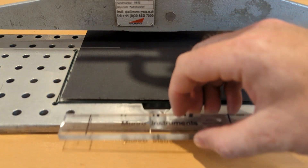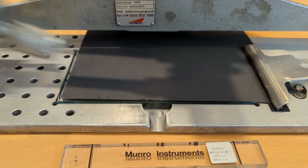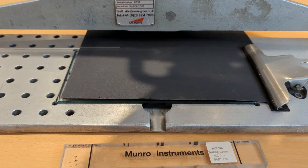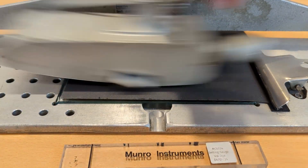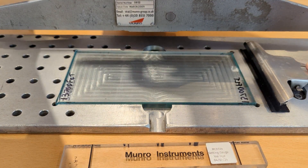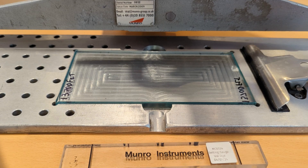With the contact patch set you're then ready to start swinging the pendulum, which will abrade the edge of the rubber slider. Because I'm refacing the slider I'm only going to do three swings, but if this was a new slider you would need to do ten swings, then reset the footprint, then do ten more swings just to put the bevel on the edge.